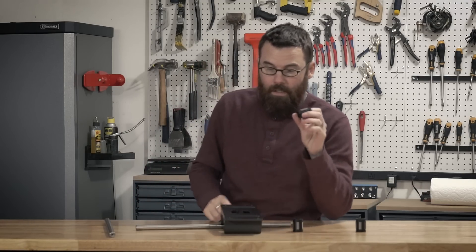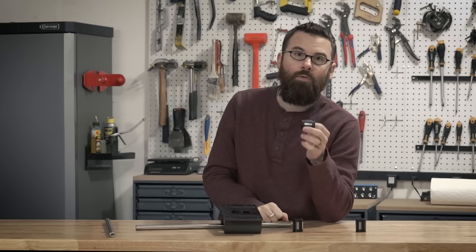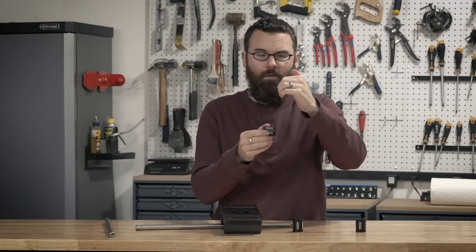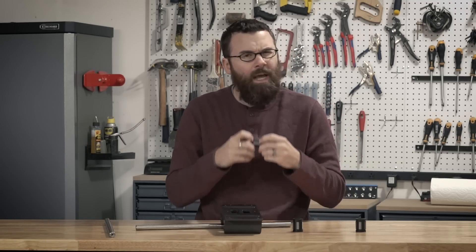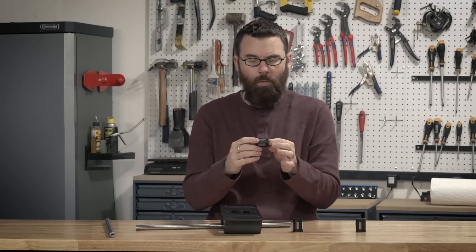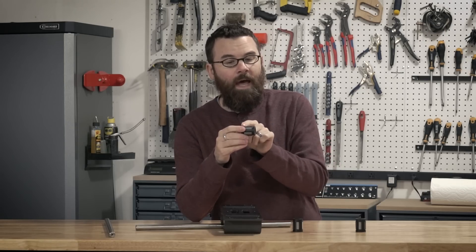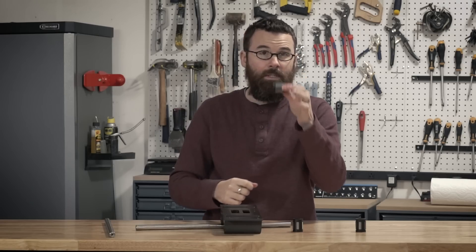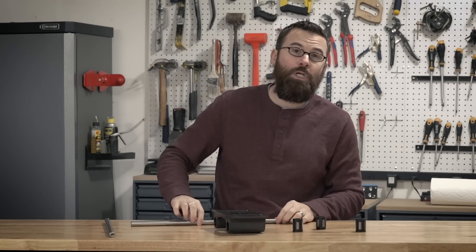The first thing I need to do for that is widen this little ridge. I'm going to use a 4-40 grub screw and this ridge just isn't quite wide enough — if I tighten the grub screw down it might crush on these outer edges and I really don't want to put any pressure on this bearing, I just want to keep it from sliding. So I'm going to put these on the lathe and widen that groove just wide enough so that a 4-40 grub screw can press against it, then drill those four holes and install everything back in the machine.